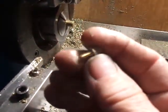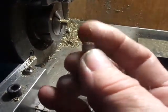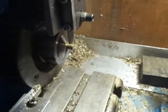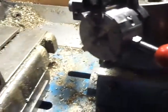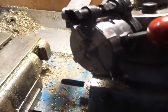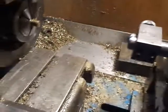These are the parts that go on my weights and the top of the stanchions that go and secure down on the post — the stanchions — for the various contacts and other things. I'm going to feature a geometric die head. It's a thread cutting die head that quick releases as you're finished. You don't have to back off in reverse with this head. I'm also going to show the stations and another neat little tool. It's called a box tool.